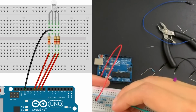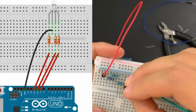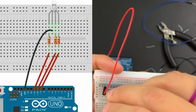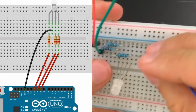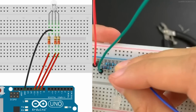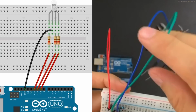That one is, we skip a pin because we've got to do our ground wire, so we're going to go off of the 3rd pin from the left, and that's this guy, so that's over here. And then we've got our last wire, which is blue, and you can kind of see I'm tracing it. So you just follow it to the resistor, to the other end of the resistor, and then over. And anywhere along that column will be the right connection.